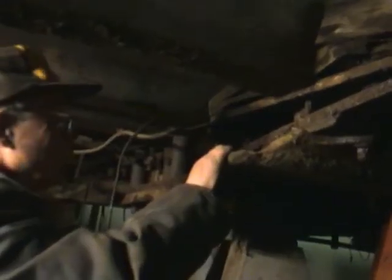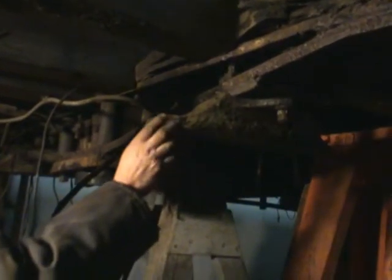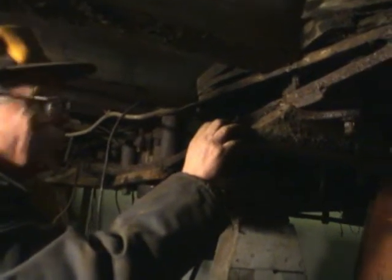So that means we're going to have to replace all of this. We have purchased and fabricated replacements. We will save the cast iron pieces — they don't seem to be affected. It's a different metallurgy between iron and steel, and iron is much less susceptible to rust.